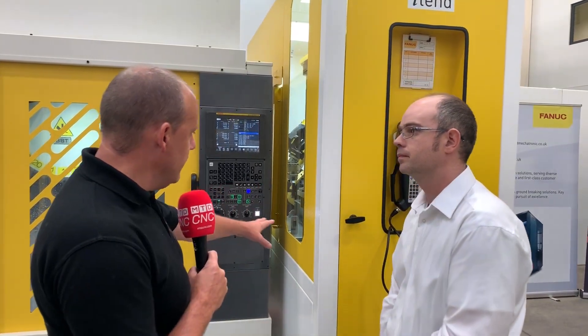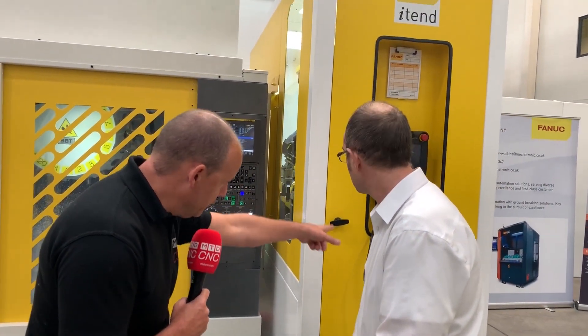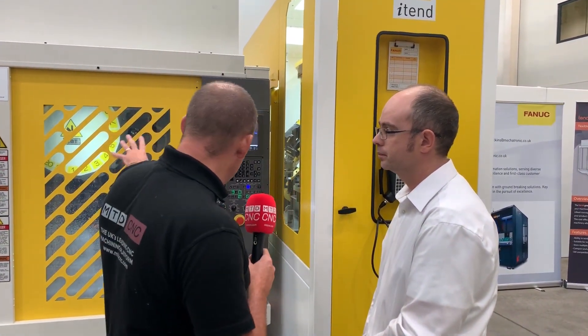When I want to load my trays I can simply open this door? Yes, this door opens and we can see all nine trays. So even if the machine is still machining you can open the door? The door has to be shut while we're loading and unloading. The idea is that you load the trays full of components — not necessarily the same components, it can be two different batches of work. So long as you can hold those parts on the robo-drill, we can program it to seamlessly change from one component to another within the same tray load.